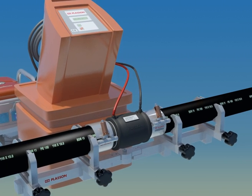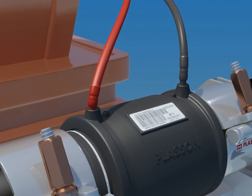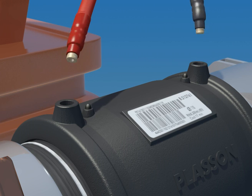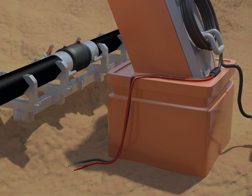Leave the clamps and re-rounders in place. At the end of fusion, you may carefully remove the terminals, making certain not to move the fitting. Take good care of the terminal ends and cables. They carry high current loads and should be kept clean and dry.